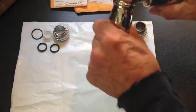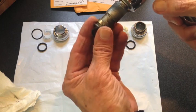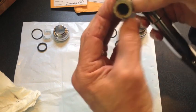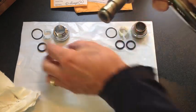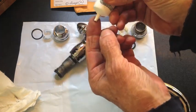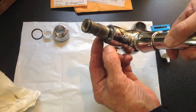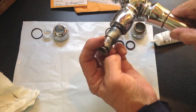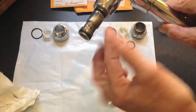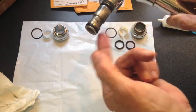I'm going to start by wiping this off and cleaning it up a little bit, then slide the new O-rings on. Once I get them on, I have some silicone faucet grease — about $4.30 from Lowe's — that I'm going to put on the O-rings. I'm going to put a little extra on this middle part because it spins and pivots, and putting some grease there shouldn't hurt anything.